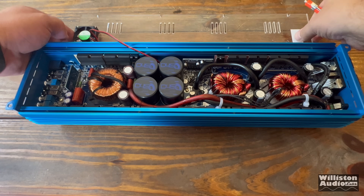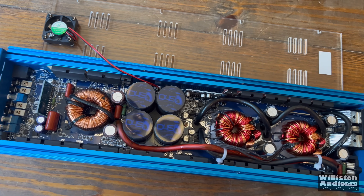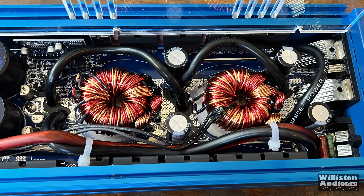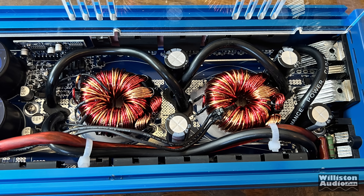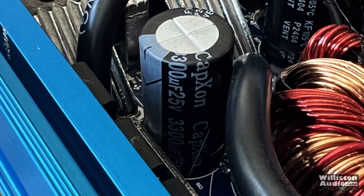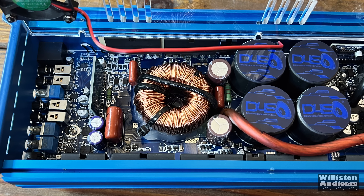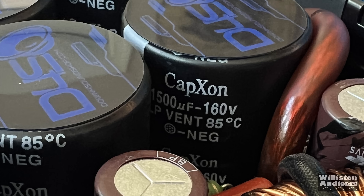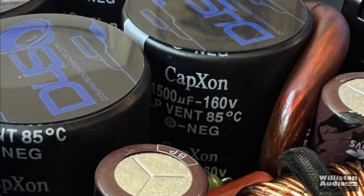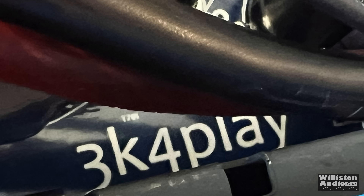Pulling the acrylic bottom off, you can see there is a fan in addition to two transformers for the power supply and a large choke on the other end — so this one is dual power supply. On the input side we have 3,300 microfarad, 25 volt caps — the generic caps the build houses use — and 1,500 microfarad, 160 volt, 85 degrees Celsius caps as well.